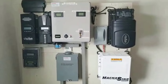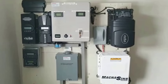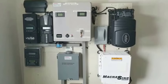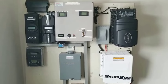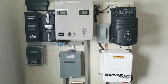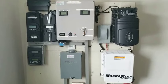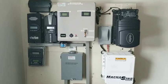It's just simple steps, probably you guys already know, but this is for people that don't know how to do it, so they can have a proper understanding about 6 volts instead of a 12 volt battery. With 12 volt batteries, you just wire 2 batteries in series to give you 24 volt, 3 batteries for 36 volt, and 4 batteries for 48 volt. So I hope this video is going to be a successful one, because sometimes there are issues with the network system, that's why I don't do live streaming that much anymore.